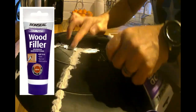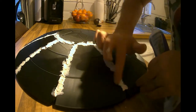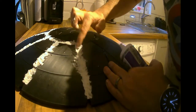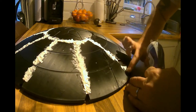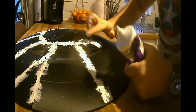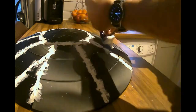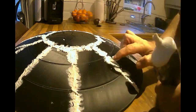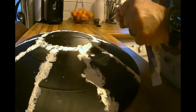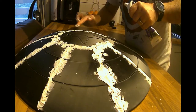Now you can see that I'm going to be filling the gaps that are inevitably going to be there on any design or project like this, and I'm just using some Ronseal wood filler to do that — putting it on and just liberally squishing it in between the gap, then spreading the outer layer on. I like to really lay it on thick and make sure all those gaps are covered, and I will be sanding this off when it goes off. It takes about a day to go off properly — they say you can sand it in two hours, but I've left it for a day just to make sure it's absolutely firm. That's filled all the gaps and now over to the sanding stage.